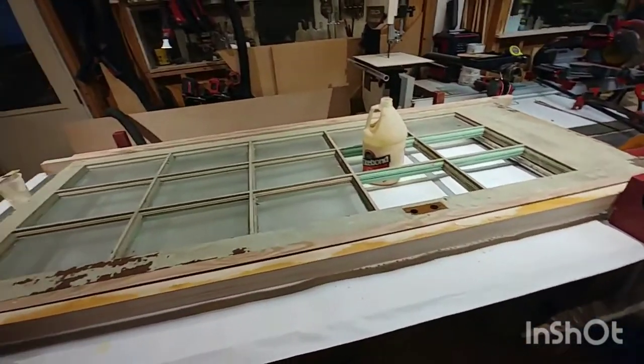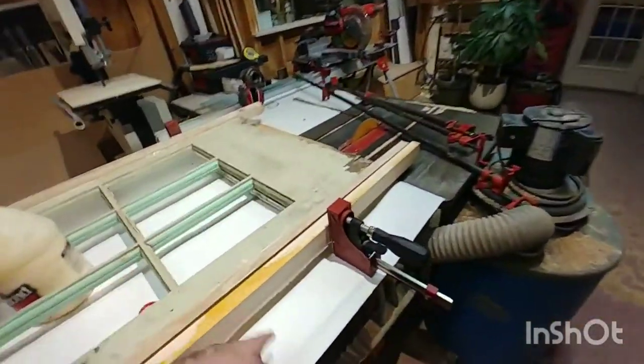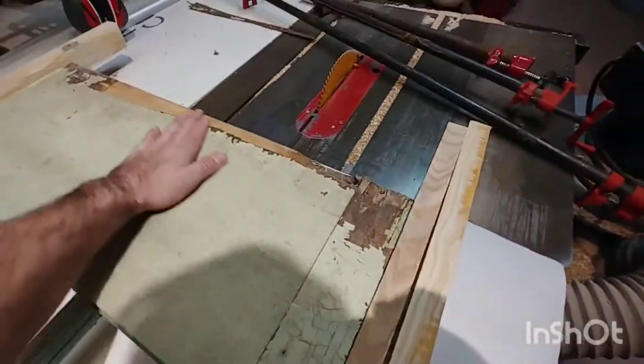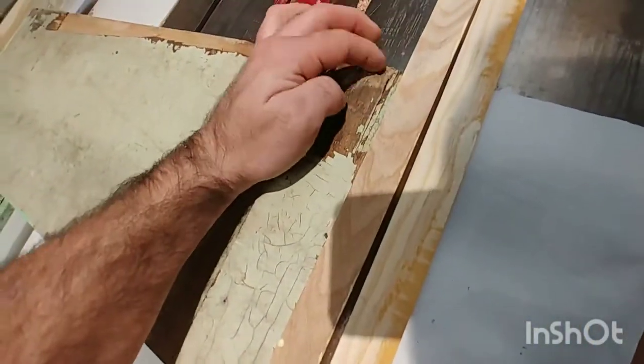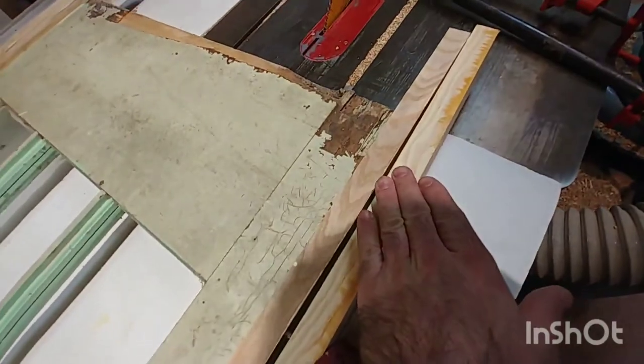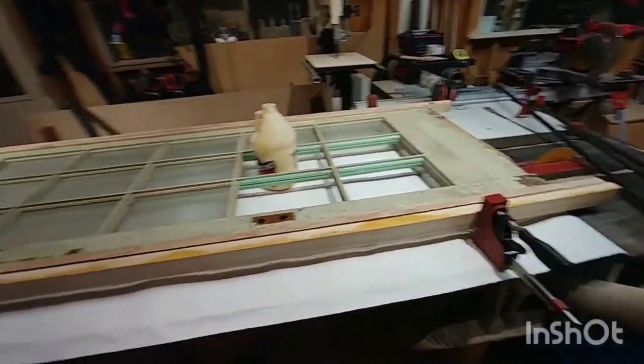We'll do all of the machining operations and a little bit of filler. There'll be filler in those holes, and then there'll be filler at the bottom of the door here all along where this is bad. And this veneer, I think, is going to let go here, but it's really easy to float that plane across with some Bondo. That's what I'm going to use.